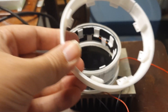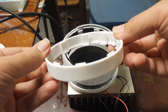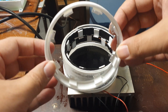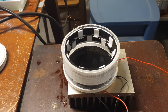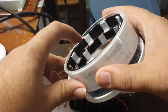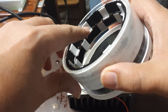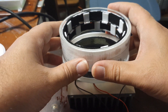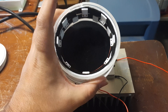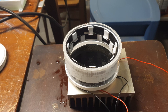These 3D printed holders have a little gap that allows me to nest the paper towel or felt in there, and then I coat that with alcohol — you can use ethyl. You'll also notice that one of the alcohol vapor rag holders has a little feature that allows me to run a wire — the high voltage line that clears ions from the chamber and allows you to get nice clear traces. The whole assembly will work without the high voltage, but having it on will let you see more traces and see them more clearly as atoms shoot into the fog vapor.